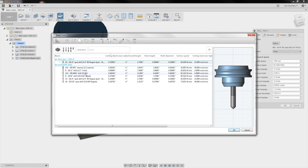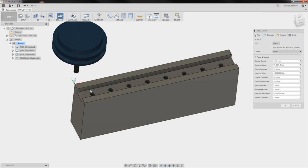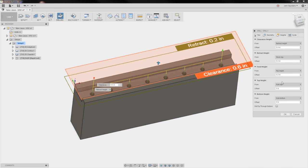Let's see here. I have a spot drill set up. Yeah, this will work. Click OK. Click my first hole and choose select same diameter. That picks all of them. We're only spotting here. So I'm going to say the top that I want to start from is the top